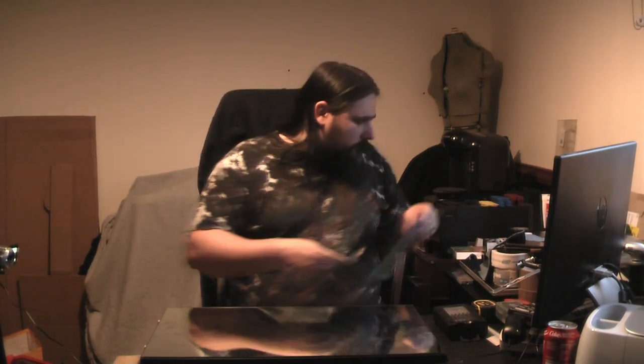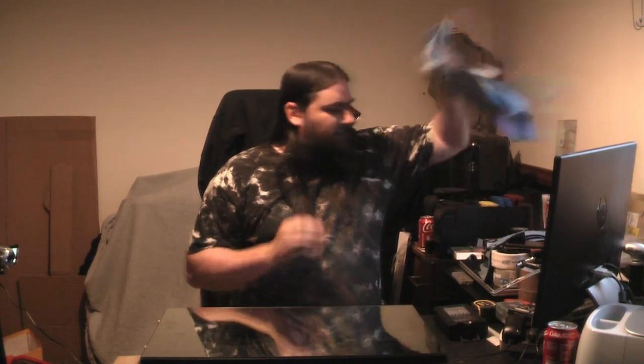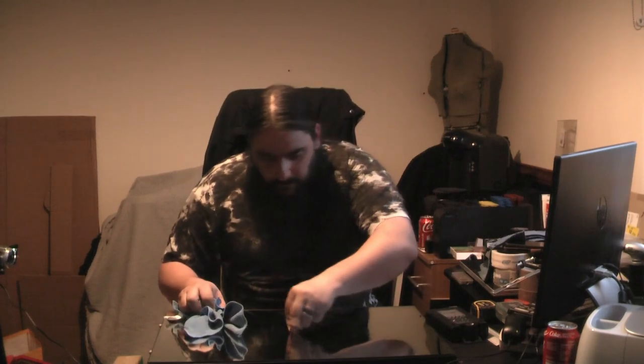Now, the only thing you need to be careful of is, one, it needs to be immaculately clean. Get a scraper, get rid of any old bits of whatever, fingerprints, anything like that. Give it a good scrub before you start, because if there's anything left behind, it will show through, or if you're really unlucky, it will actually embed into the resin and then stick on the surface. So then you'll be stuck with whatever bits of whatever is on there. So give me 2 seconds, I'm going to quickly clean this now. So, get that nice and clean.